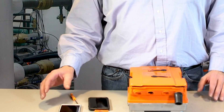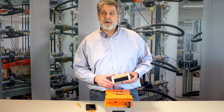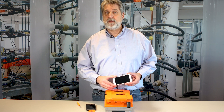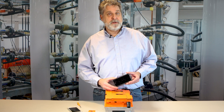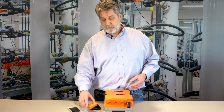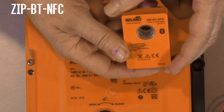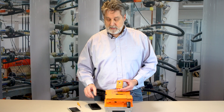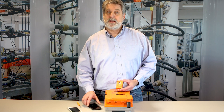If you have an Android phone, you can access the near-field communication on the PR actuator without any adapters — Android phones have NFC available and active. If you're using an iPhone, the near-field communication is not activated. So Belimo has created a device called the ZIP-BT NFC, which communicates with the actuator through NFC and then communicates to your iPhone using Bluetooth.